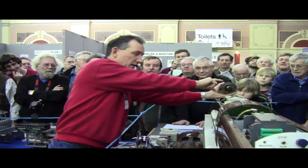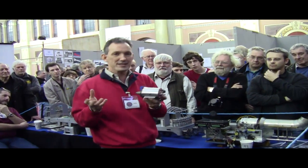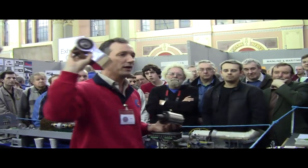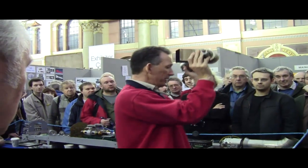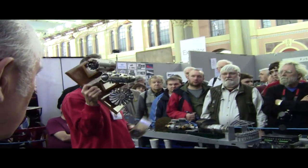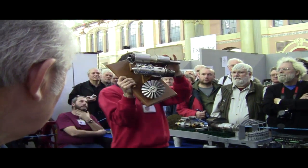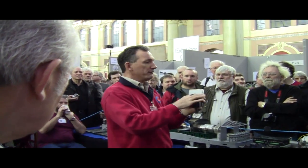As you can imagine, a jet engine sat in a locomotive with hot, high-speed air coming out the back end is not ideal for the passengers in the carriages behind. So what we have to do is turn it into something more useful for the application. We effectively introduce a windmill in the gas flow — what's called a free power turbine. It goes in the gas flow behind the jet engine inside a duct. All that high-velocity, high-temperature air has to go through this wheel, which takes all that heat and velocity and converts it into shaft power.